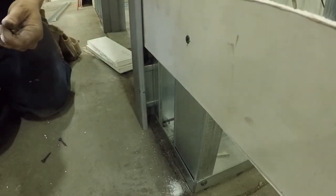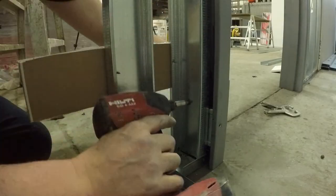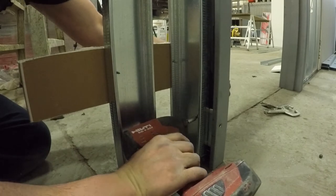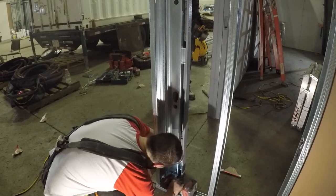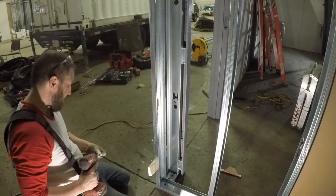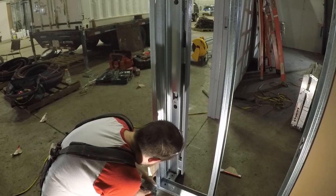This is why it's so important when you're framing to have your walls level and plumb — plumb up your hinge side. You want that plumb perfect, because then all you have to do is use your tape measure to square over at the end of the day. You're only going to square the bottom over. I'm going to pop a screw in the bottom and a screw in the top so I know the door is secure and snugged up to the drywall. I'm going to test the other side as well — make sure that drywall does fit on the other side. I'll go around the frame and make sure we don't have any issues.